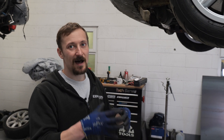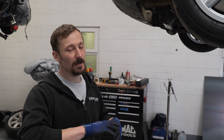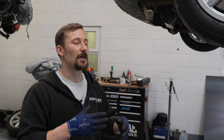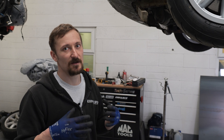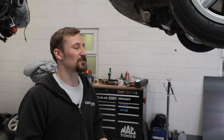We're really starting to tie the major structural components of the car together now. What I need to do is create the rear over-subframe chassis leg, which is going to pick up on the suspension turret and then the front and rear subframe mounts and just tie it all together. There'll be some sheet metal work using mostly three-mil plate — it's a little over the top, but I want it absolutely bulletproof. So it's going to be cardboard patterns, cutting out more sheet, and getting it tacked in.